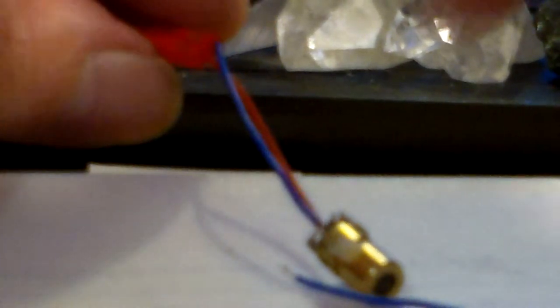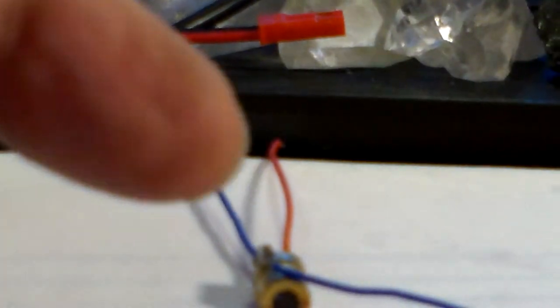you look at your laser dot, right? The best thing to do is, if you can, aim it at a building that's okay for you to aim it at, that nobody freaks out. And these lasers are actually made, you see, like this main body piece up here, and then it gets small right here, and then there's like the PC board and the back half. Well, this front half of the laser, you can take it and turn it and adjust it to make sure that it's a nice little point at a long distance away.